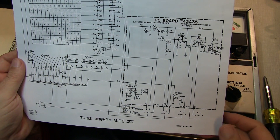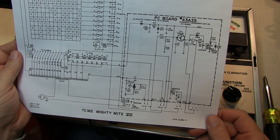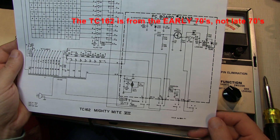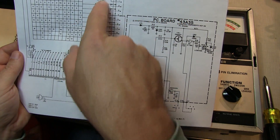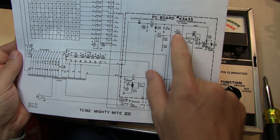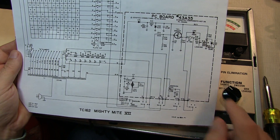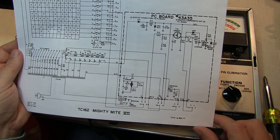This tester was actually built in the late 1970s, making it a late model in terms of tube testers, and one of the advantages is that it's solid state — there are no vacuum tubes in the schematic. There are a number of switches and a multi-tap transformer, and a JFET is used in a balanced bridge configuration to drive the meter for the emissions and grid leakage tests.